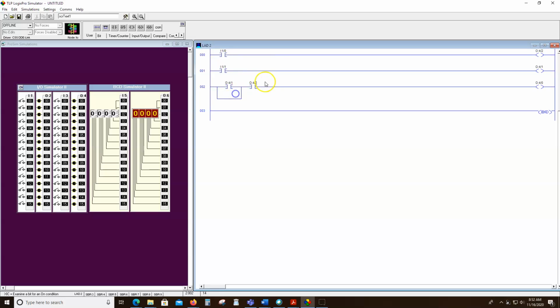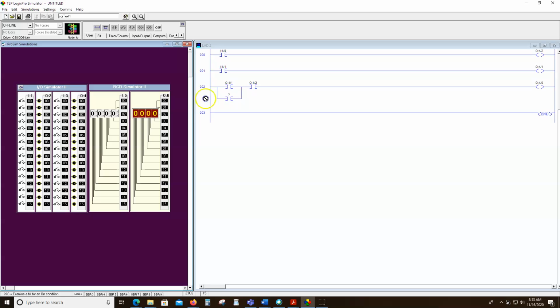And we'd have to drag this guy down into our branch, which is sometimes easier said than done. Let's do this. Didn't want to light up for me here, so we'll just do this. We'll cheat. Put 4.2 there, and then we'll get rid of this guy. Same essence. So before I had them side by side, and that was an AND. This one and that one would have had to be on. Here, either has to be on, and we're going to be on. So I'm going to re-download this program, and I'm going to hit run.